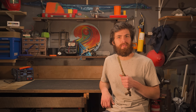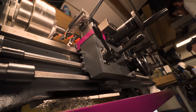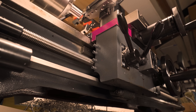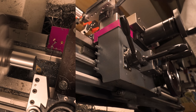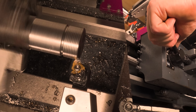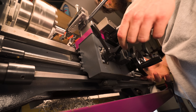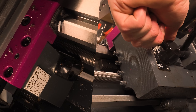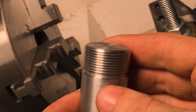More or less. At this stage, if we just ignore the control panel for a second, everything was working exactly as it was before. The motion of the lead screw and feed shaft is linked to the motion of the spindle via this gearbox. Power feed is still engaged with this lever, and I can still cut a thread just like everyone else using the half nut and thread dial indicator. The only difference is I'll never have to switch out the change gears again.